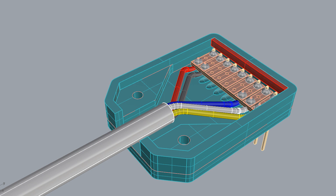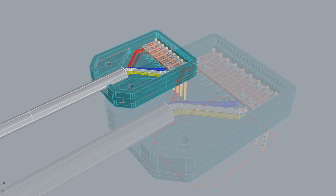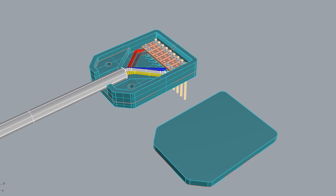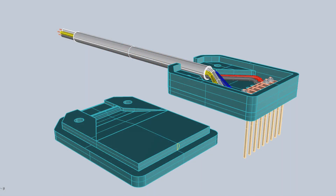Here you see it again with the wire and all the components replaced. Now at the far end we need a little nose cut into the plug in order that the lid can latch underneath — there we go, we've got a little lip. Then the final bit to make is of course a lid, which will be the same outside profile extruded up, with a step to fit within the walls of the plug and same holes pushed through in the same places. I wanted to make a little indentation in the top which would incorporate a cord grip — you can see the ridge to grab the wire as it comes in — and add the nose on which will engage in the lip of the back of the plug.